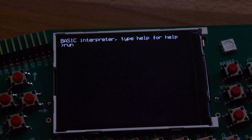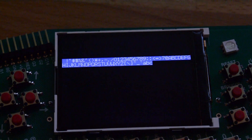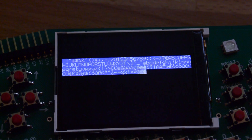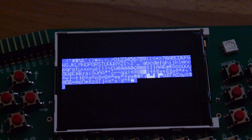The other thing that we have is EGA 16-bit color on this screen and the extended ASCII character set. Here's just a little demonstration with a delay in there. There's also a lot of other things you would need like random and the ability to clear the screen and address different places. The way that this is set up is it is a VT100 screen — it's 40 characters by 20 characters. You can turn that off if you want to write your own code and refresh the display yourself. That'll all be detailed in the project repository itself.